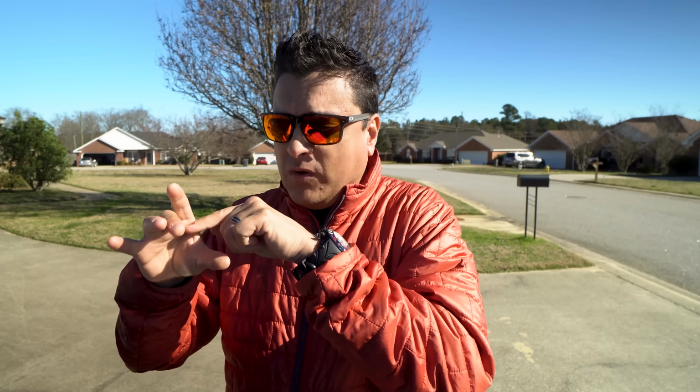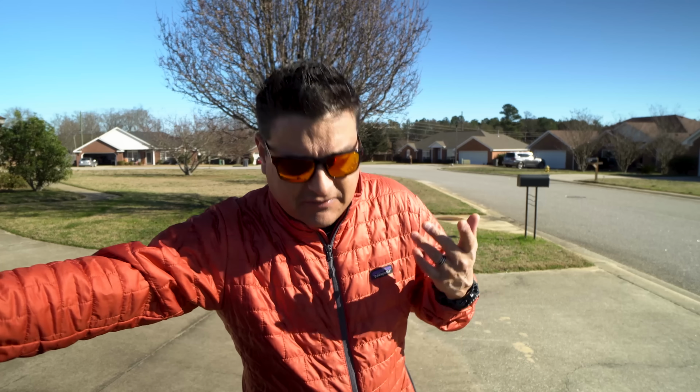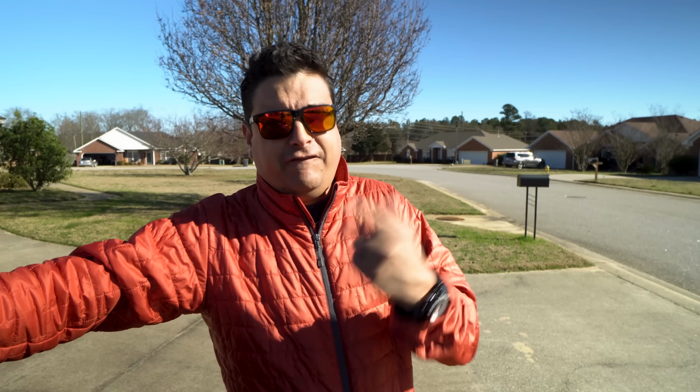So be careful when you're shopping for pickups that you don't just lump everything together. People do this with Filtertrons and they do this with gold foils because it has a piece of gold in it. We could do a whole other video about that. It has a piece of gold foil in it, so it must be a gold foil. No. There's a lot of fake humbucker Filtertrons out there that are just a humbucker with a toaster top pickup cover and 6 more screws. And they're just a regular humbucker. And they're not interchangeable because they're different sizes. There's a difference between a humbucker and a Filtertron.